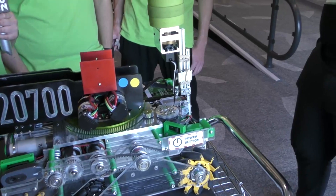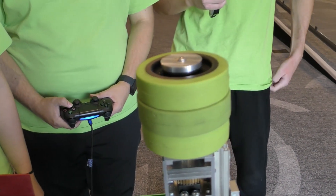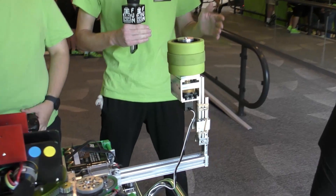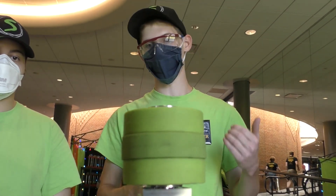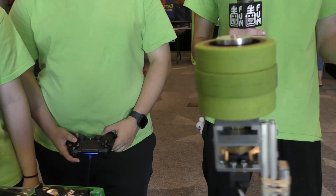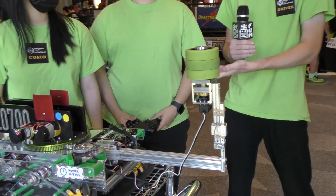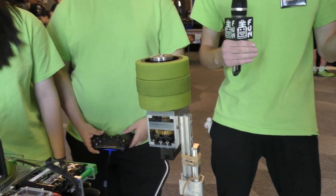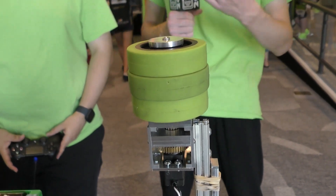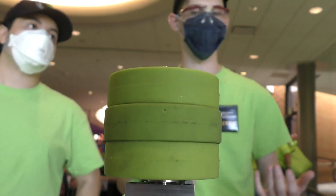The last hardware component I really want to talk about is your carousel mechanism. At first it may seem simple, but during matches I see it just spring out and it's really impressive. So originally the carousel mechanism was just bolted onto the frame — it didn't extend at all for the first iteration. But going into our AML league meet three and AML championships, we realized there was a competitive advantage if we could deliver ducks not only to the field but also to the alliance hub. The arm was already cantilevered four and a half feet, so we realized the only way was to get the carousel mechanism further away from the robot. We went with a lead screw design that goes through the center of the robot because it's compact, efficient, and very quick for deployment in endgame — and the robot still fits inside the 18-inch box at the start of match play.